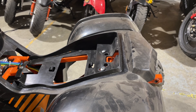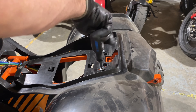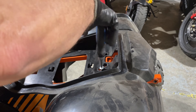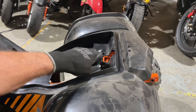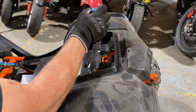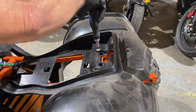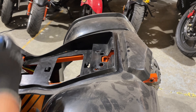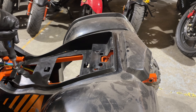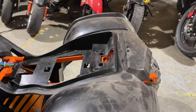I keep a 5mm on a driver because it's a lot easier. I use my 5mm a lot, but you can use a 5mm Allen key to do the same things. Keep something to keep your bolts so they're not all over the place. We also have to get this one underneath — there's a nut. You can usually get the nut started and then just hold it while you unscrew it. If it has a locking nut on it you're going to have to use a 10mm; this one doesn't. All our top bolts are out.